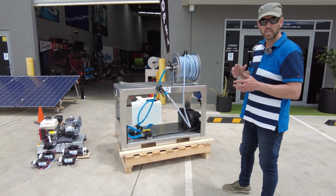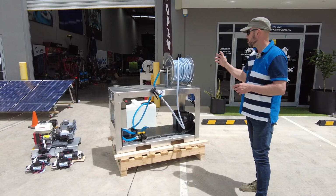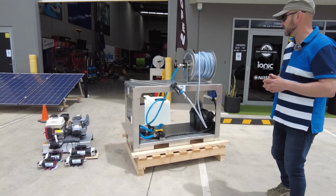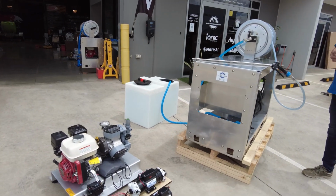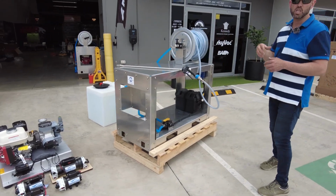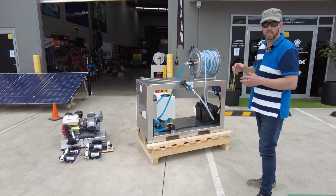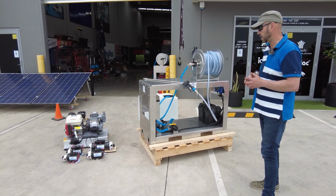Hose reels is a choice. 50 metres of 1/2 inch hose to suit those pressure cleaning requirements. Upgraded swivels, tanks alike. We have a 150 litre tank on the back as a solution mix for your batch mix system. The hose is just going into the top of that, but it will be uni-seal and will allow the customer to do that depending on what side of the tank he wishes to put that suction hose into. So strainer on the end of that hose as well with titanium clamp.